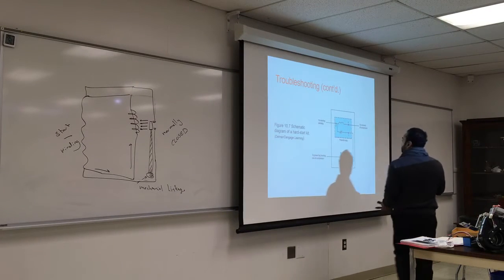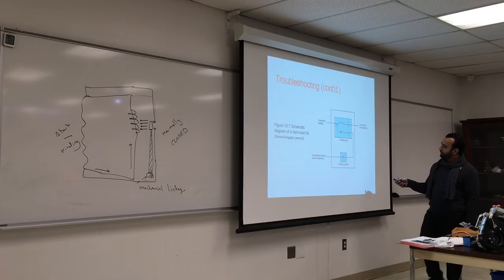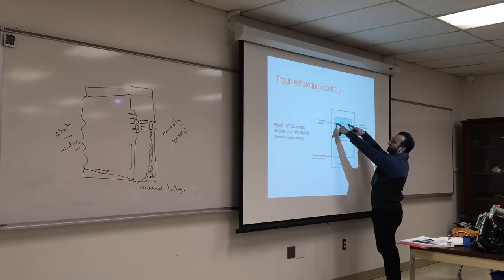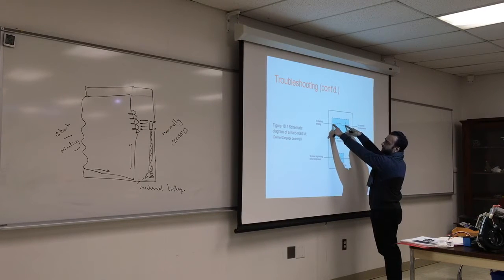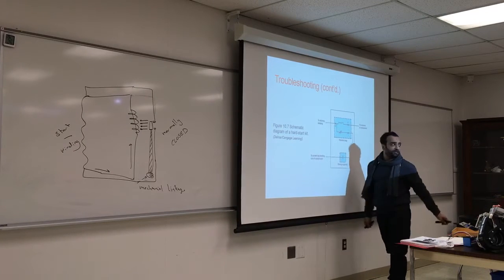That's what it looks like. So this is going to the compressor. It's going to the start winding. It's my relay, it's normally closed. And this one goes to a start capacitor. So when you want to check the relay, that should be between 2 and 5, and it should give you a reading. And if you check between 1 and 2, it should give you a reading because it's normally closed.